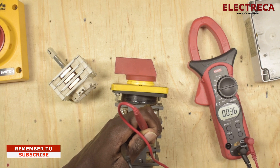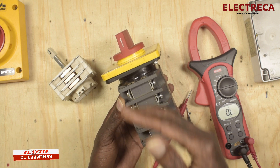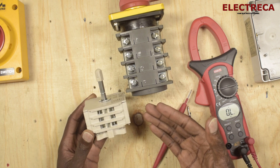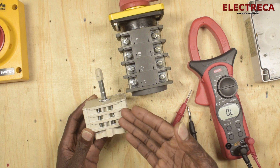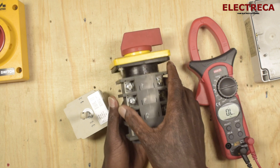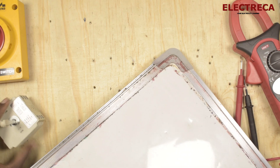There is no short circuit — your generator and your main supply will not meet. This switch allows only one source at a time. The same applies to this smaller type, which usually works on single phase, unless you're supplying a three-phase motor. It has four contacts: three-phase and a neutral, depending on what you want. That's basically how this kind of manual changeover works.